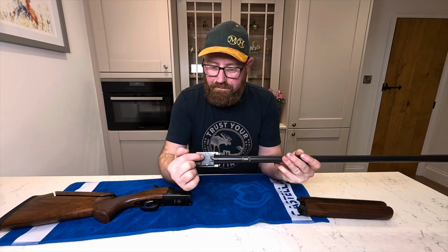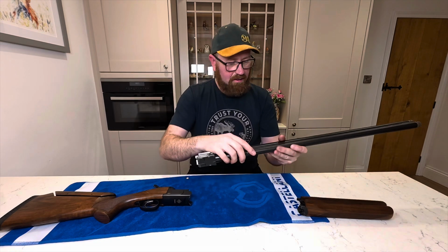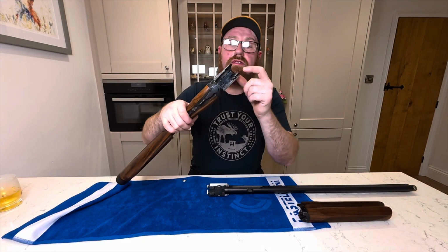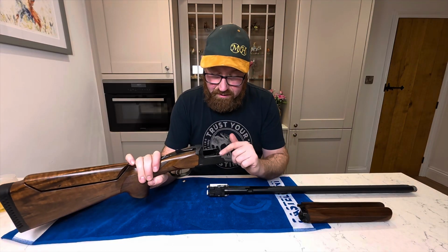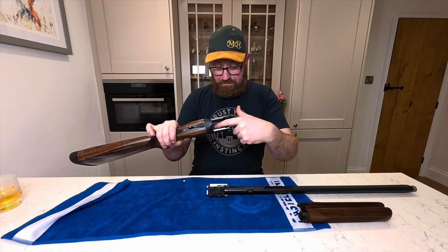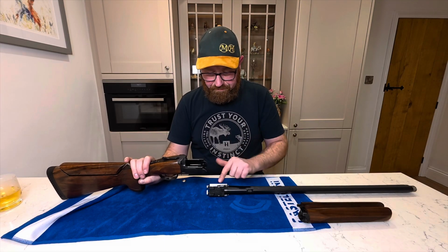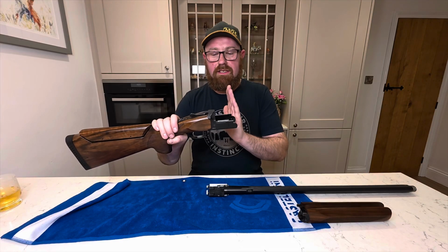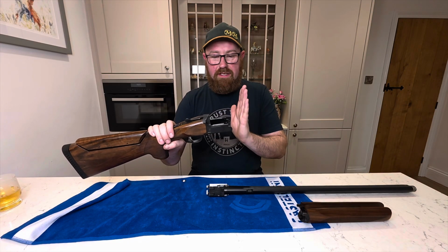We've got these recoil shoulders here on the bottom. Now then, yes, so if we look into the floor of the action, we can basically see that is where the recoil shoulders are on the lumps of the guns, and they engage, and basically when they lock in, they stop the barrels coming off face.